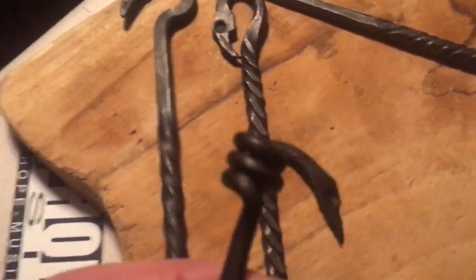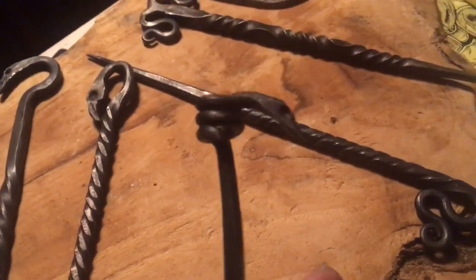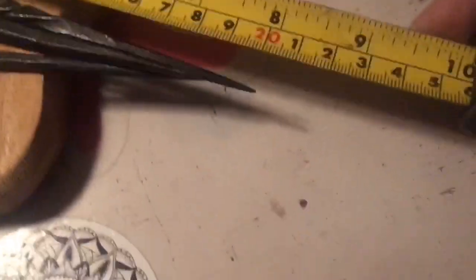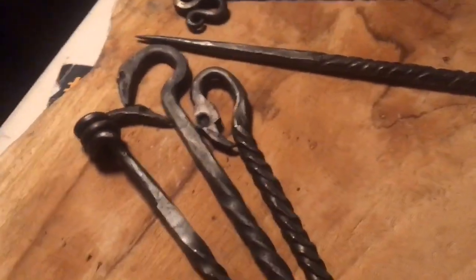I made also this one — I forged it into a square and then back to round, very long, then curled it up. I like this one pretty much, it looks quite good. With a little twist here. In the beginning it was 130mm, which is five inch, and now we're at 200-plus, so quite a lot of pounding for this result.